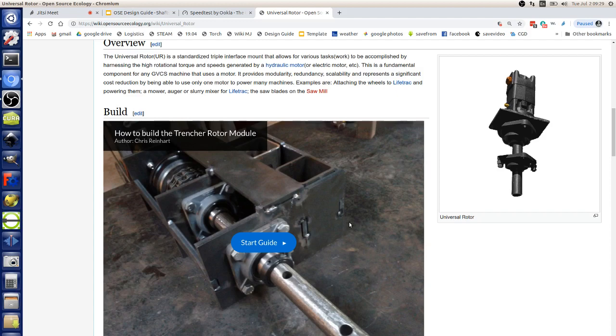That applies to small stepper motors and to the universal axis. When you've got that much separation on a shaft and you put a very heavy load on it, it's not moving anywhere. The basic design is two strong half-inch plates, with a motor behind that. The motor doesn't serve to hold the force exerted on the shaft — the motor is coupled through a chain coupler. This is our universal rotor, which you can attach to a tractor, a big trencher, or any rotor, while keeping the tool head super stiff.